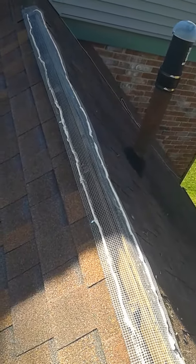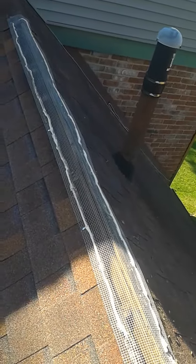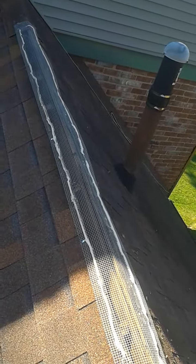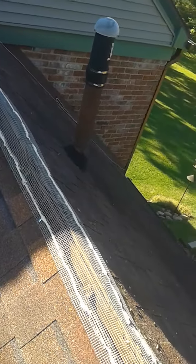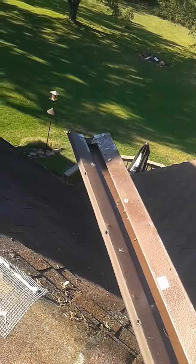And not only do we screen it, but instead of using nails which tend to work their way up, we screw it down and then we glue it down, so it's not coming up. The only problem with this is when you do have your roof replaced, your roofers will be cussing up a storm trying to get it off because it's been installed so well. So that is how we take care of bats in a ridge vent. Thank you.